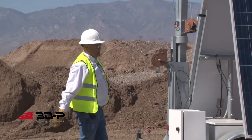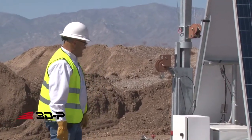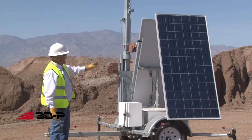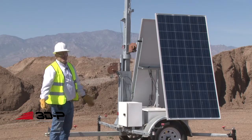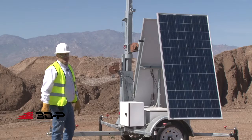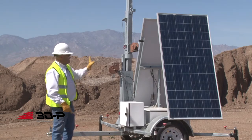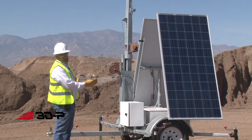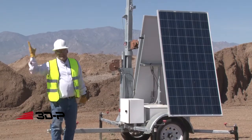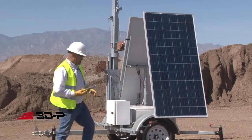The last thing we have to do is change the alignment on those solar panels — we want them facing towards the sun. One feature to talk about is where the solar panels are located on this trailer. A lot of times you'll see trailers with solar panels either on the mast or near the mast — that is a really bad design flaw. Any shadow across the solar panel will reduce its effectiveness, potentially by as much as 80% from something as small as a branch across one panel. So with this design, we've put the panels at the back of the trailer and the mast at the front. You face the trailer towards the sun so that all day long the panels are in front of the mast and the shadows fall in the other direction.